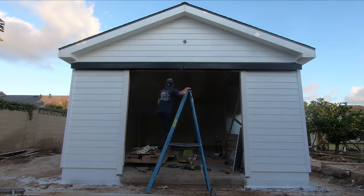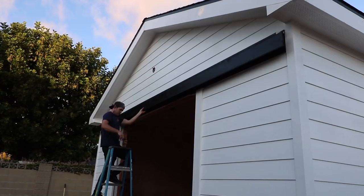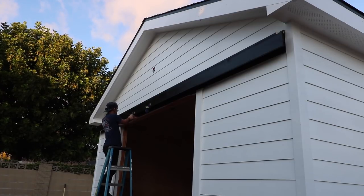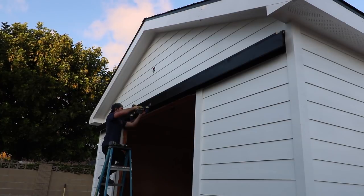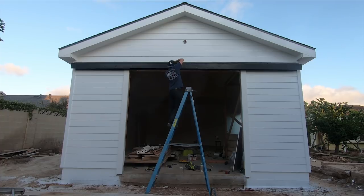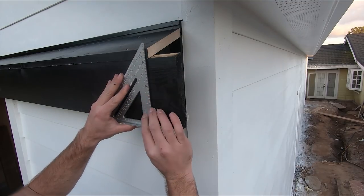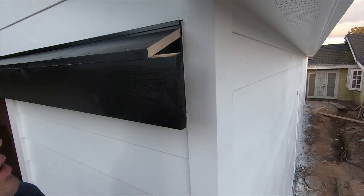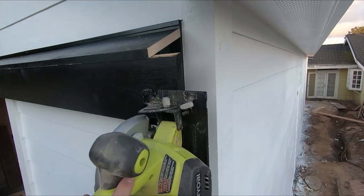For the second board, I made sure the center seam was as tight as possible. I used two 10-foot long boards for this front face to overlap the seams of the top face. I was careful to drive screws into the center of the board so a screw didn't stick out the front or back. This front face is the least supported of the entire cover, so to prevent separation at the center seam, I put a backer board behind it and screwed it in from the front — it was a leftover cutoff piece already painted black, about two feet long. I left the pieces long so I could get the seam right in the center, then marked the ends with a speed square and cut them flush with a circular saw.